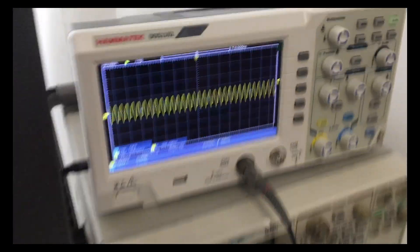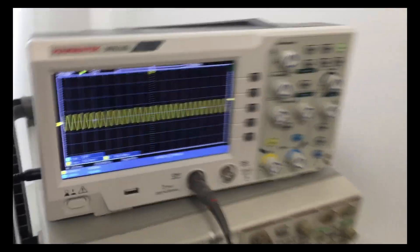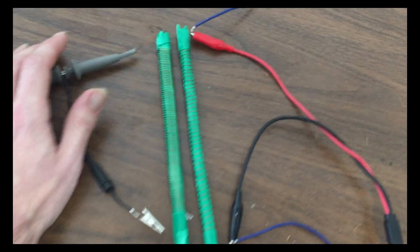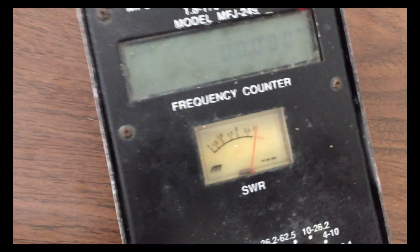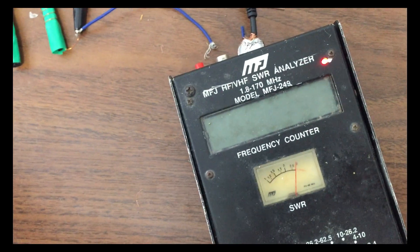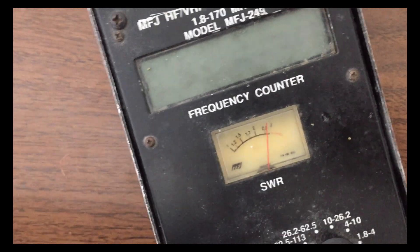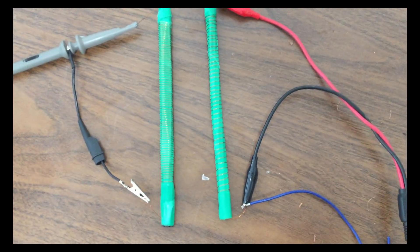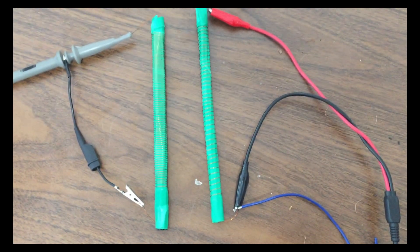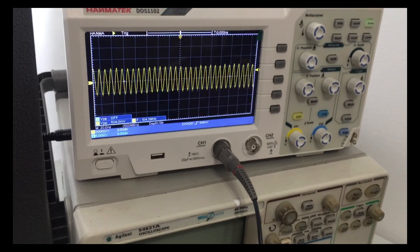If you look at the scope here I'm connecting to it, there's the waveform at 104 megahertz and it's detecting about 300 microvolts. So we're going to start changing the distance. As I change the distance, you'll see the meter change a lot. I'm moving it just a little bit and look at the meter dynamics change. The meter is going down as I'm increasing the distance — now it's not feeling the reflection but acting more like a traditional transformer, transferring part of its energy. Looking at the scope, now we have a much stronger reading — 600 microvolts — because it's more of a traditional coupling at this point.